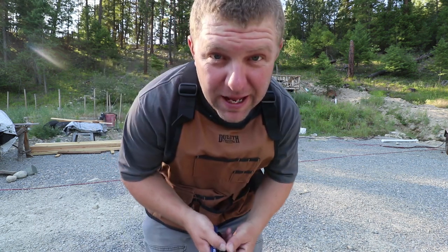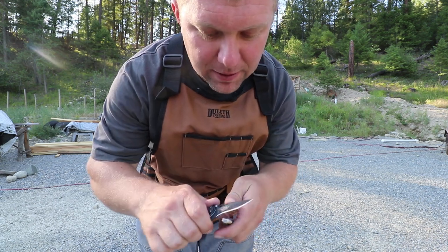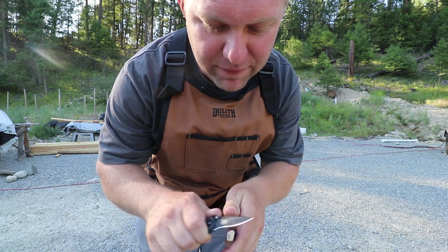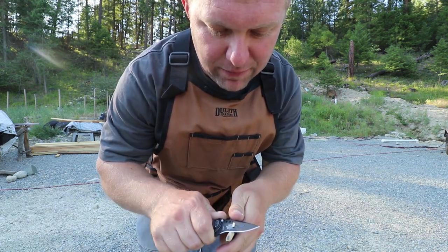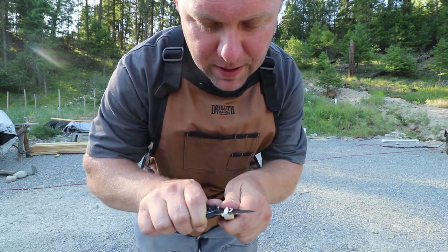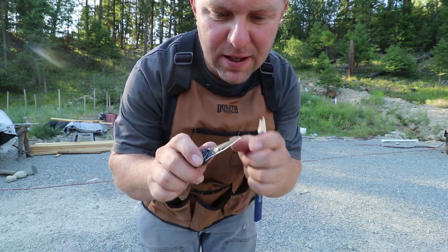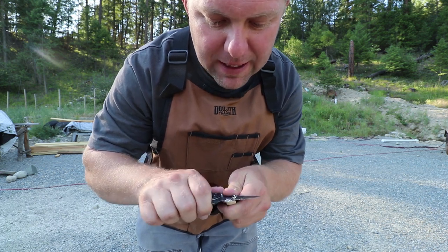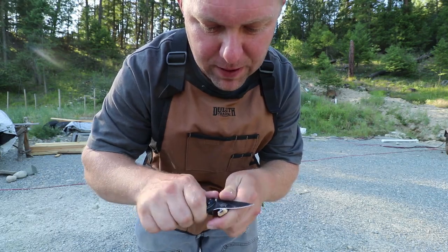One thing we did learn at the timber frame workshop was to sharpen your pencil. Alyssa and I had been making a lot of mistakes, and a lot of our stuff is off when we cut it because we're not aggressive enough with sharpening our pencil. So something we learned is that when it really matters, you need to mark with a knife so that it's precise enough. Even the width of a pencil can make a difference in the quality of whatever you're building.